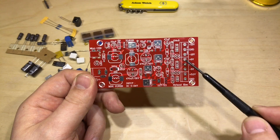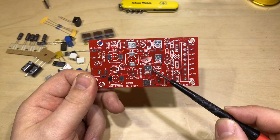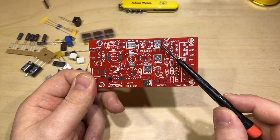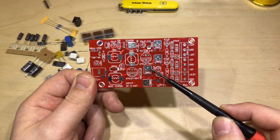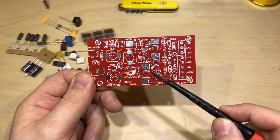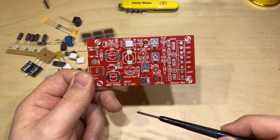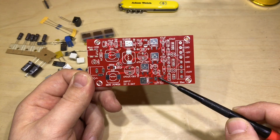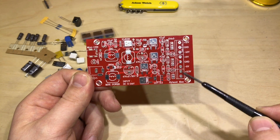I don't believe there's much current on these outputs — if I remember correctly it's 300mA per channel. The linear voltage regulators placed here are the 78M12, which is a surface mount version of the 7812, the 7805, the 79M12 which is a negative voltage regulator, the 79M05 also a negative voltage regulator, and then an AMS1117 3.3 voltage regulator for the 3.3 volt rail.